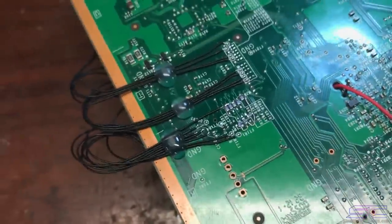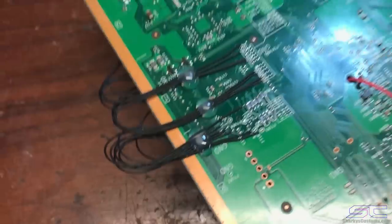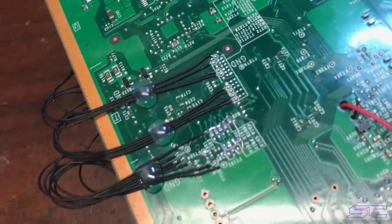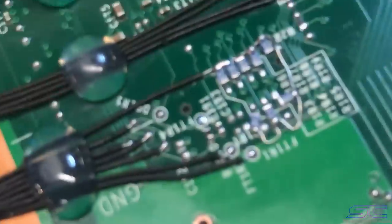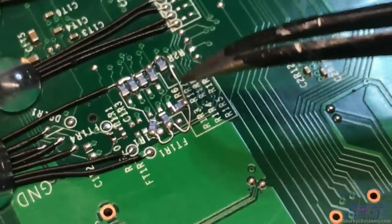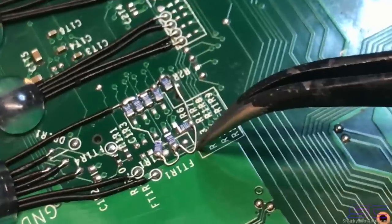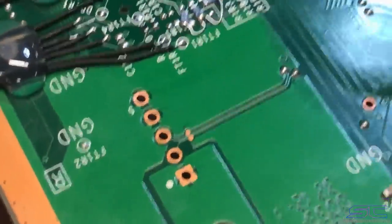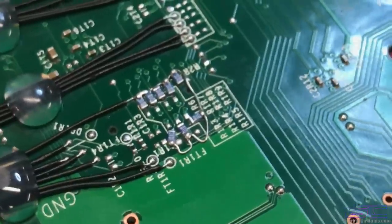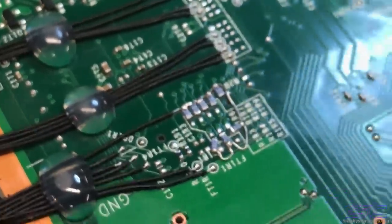I'm going to go ahead and flip it over and show you guys this. You guys are going to be like, what the hell? But there are no QSBs or anything to make it look clean, so you have to wire everything up like this if you're doing a 4 gigabyte Corona. These are the 10K resistors right here - you have to use a wire and bridge each one of these. When it's 3 volts, it's going to be on the retail NAND. When it's not on the retail NAND - when it's on the RGH side or dev kit side - there's going to be a ground going through this which will enable the NAND to actually work and let the console boot.